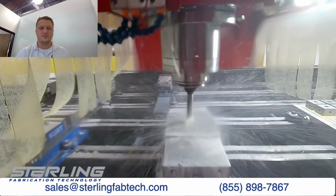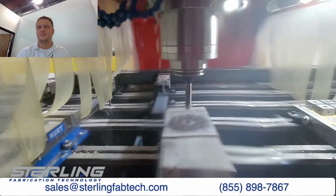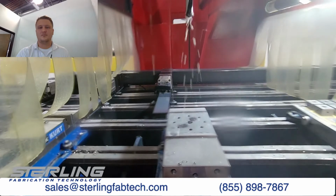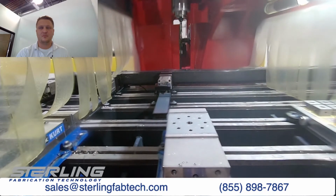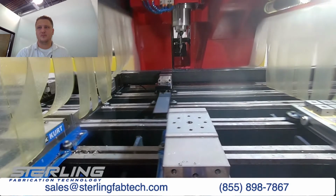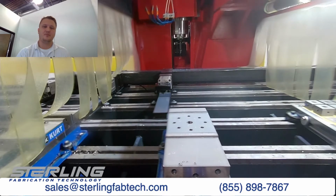So Aaron, while this is running, is there anything special about this operation that you feel the viewers need to be aware of, or you'd like to at least share? It's going to be this next tool, really. Okay. This is where we're going to get into that high feed mill that I was talking about. And what's nice about the high feed mill is it's a very shallow cut. So you're moving very, very quickly, taking a very light cut.